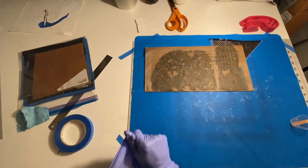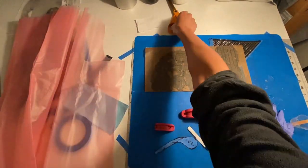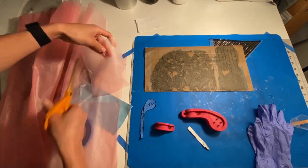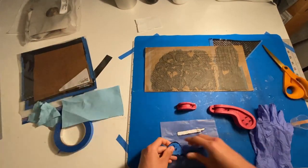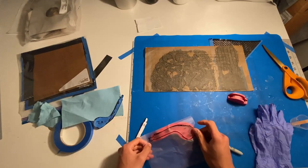I'm going to let the epoxy cure a little bit to become more tacky. While that happens, I'll prepare the release film, breather, and bag. The pink material is perforated release film, which will be in contact with the part when curing and is easy to remove after the fact.